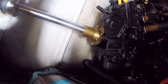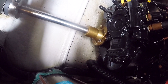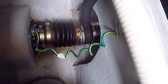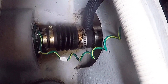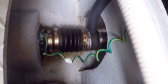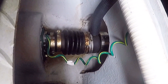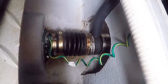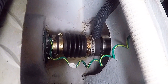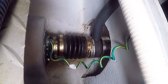We may have to realign the shaft, which means unbolting that, getting our feeler gauges out, and adjusting the motor mounts. Here's the other end of the PSS shaft seal - you can see it's a rubber bellows that keeps tension of the graphite seal onto the stainless disc mounted to the shaft. The only part that spins is the stainless shaft disc and the shaft itself; the graphite seal and the bellows stay stationary.